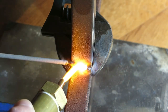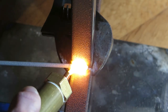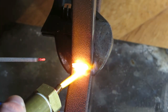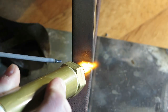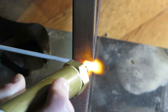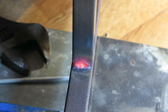Attempt number one: two mild steel square tubes and a welding electrode. Here you can see my torch — it's pretty bulky — and the flame it produces. The yellow color of the flame means it is very contaminated, and we will take a closer look later in this video. Well, this weld is pretty crappy. It looks like the filling material wasn't joined with the steel. So I repeated this experiment and tried to put more heat into the welded area, however without any success. Maybe more heat is necessary, or maybe there is some other problem. But the main problem is that I am not a welder.